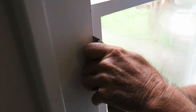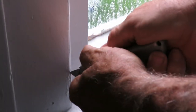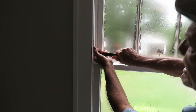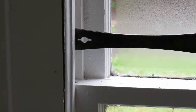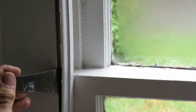That crackling is a good sound. This perimeter stop is rather flimsy and it's certainly very easy to break a piece of it. If that's the case, we'll just replace it. I'm going to try to get behind it with a slender pry bar and very gently attempt to get this thing off without breaking it.